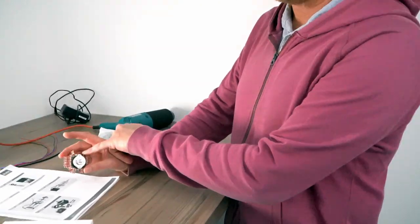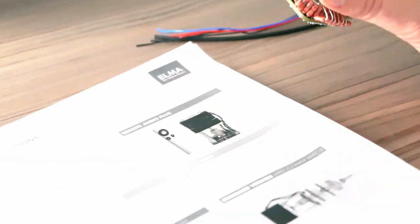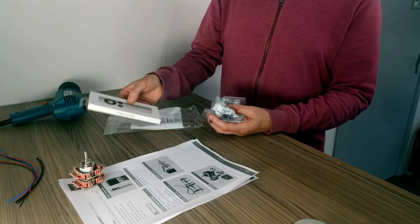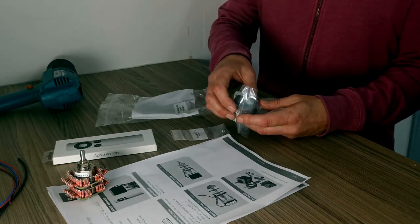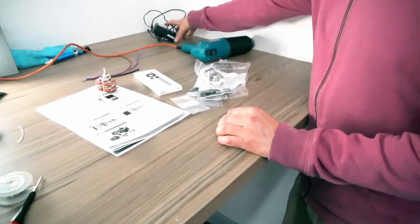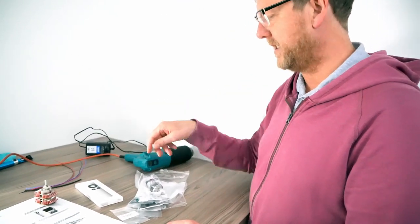So let's see what we've got here. That's all finished, that's all been tested. It doesn't have the load resistor fitted as yet, but that's by the by. This is the instructions for it. This is what you get in your bag. There's your Apple remote. We also sell a wall wart power supply. This requires at least a 1 amp 12 volt DC supply. So we've got one here. I mean, that's for something else, but that does the job nicely.